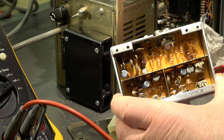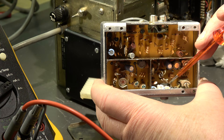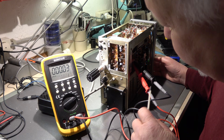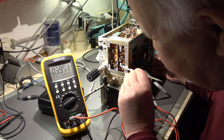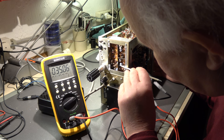This is the final transistor here — it's also a mess with the thermal compound. But I don't change it here, I leave it as it is; it looks rather good. I only improve it on the driver side. Now I'm able to align the bias current of the driver transistor. I'm looking for a setting where it doesn't run away — that's okay.